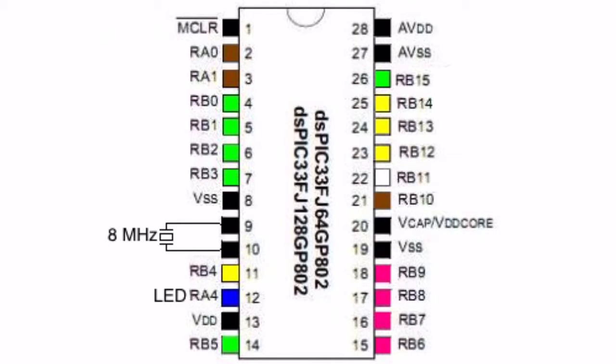In pink, the SPI hardware for the SD card — SD data in, out, clock and chip select. In yellow, the additional pins for the MP3 decoder chip, which shares the hardware SPI bus with the SD card.